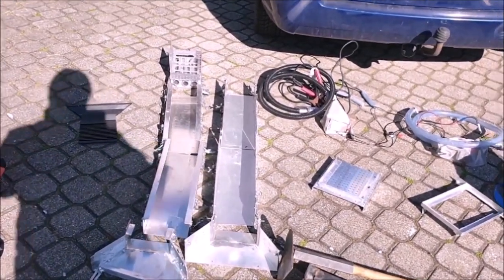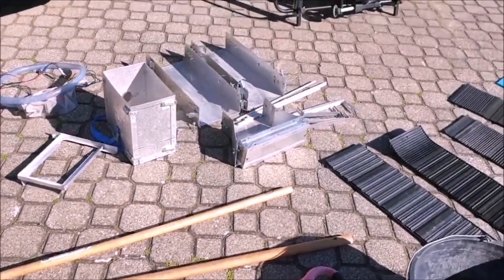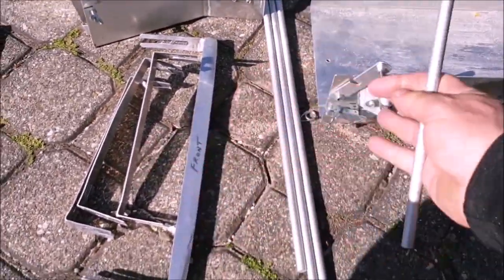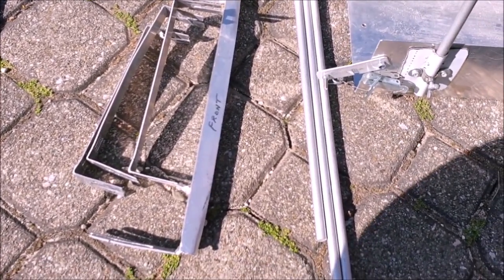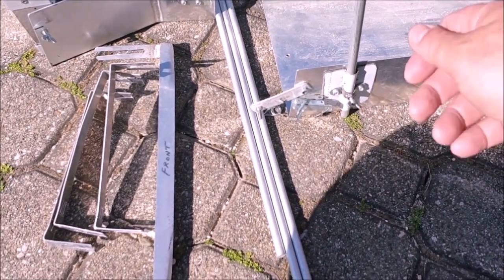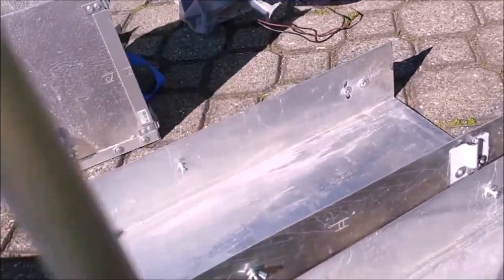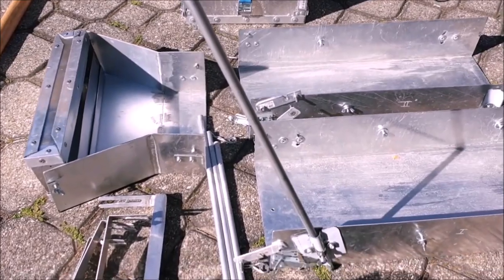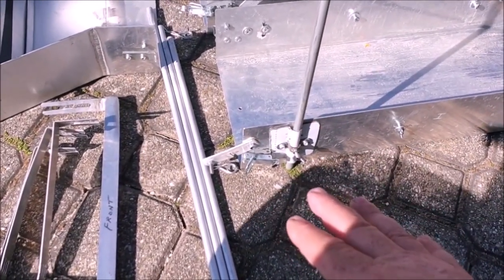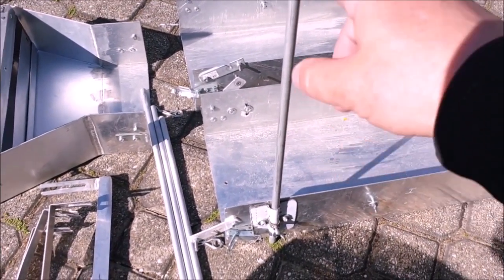Two separate pumps may be the point if I'm using this set up as a high banker. You'll notice I've got legs for these things. My legs fit into here and it's designed so while it's loose I can actually angle the sluice to fit into the stream, then the legs dig down into the gravel. The added bonus is I'm not having to stack rocks underneath it to try to get my angles - all of that is adjusted by the leg settings.